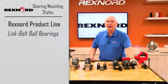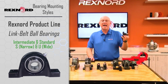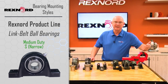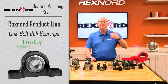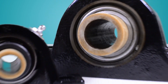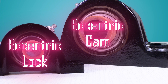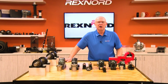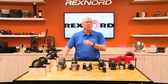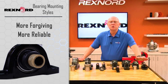Also, in ball bearing standard duty and intermediate duty, we have the S and the U inner ring. In medium duty ball bearing, we have an S inner ring. In the heavy duty ball bearing, we also have a U inner ring. Next up, eccentric lock or eccentric cam. These are very popular in ball bearing. They are still very easy to install and their cost is still relatively low. They are a little bit more forgiving and a little bit more reliable than perhaps a set screw or a set collar.